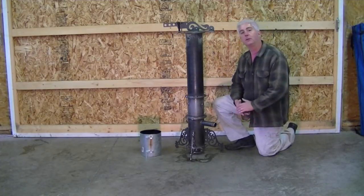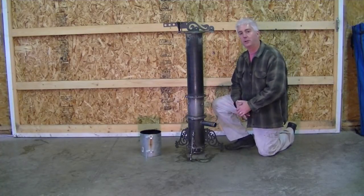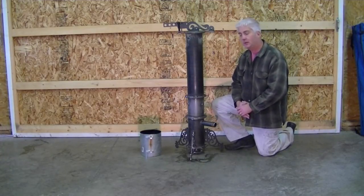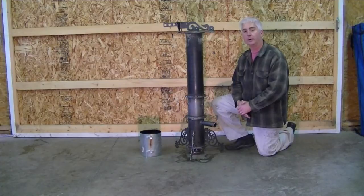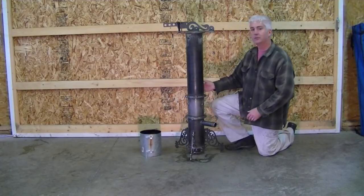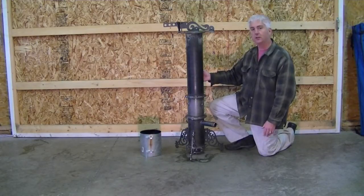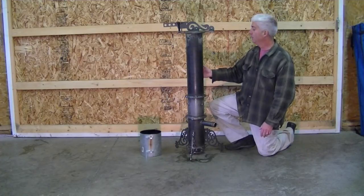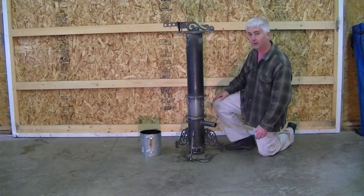Let's go up to the fuel hopper. You'll notice the plain carbon steel — that was at the request of my welder. They were galvanized for 2014, which was nice for rust, but his weld quality just wasn't what he wanted. So we're going to carbon steel. This doesn't see any heat, it can be painted, it's not a heat transfer surface. Still 24 inches, still the same capacity, same run time, same everything else.